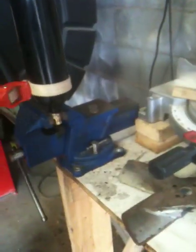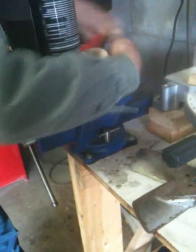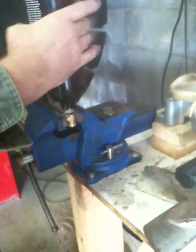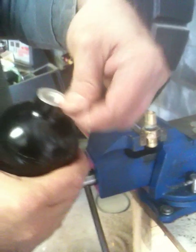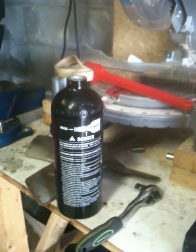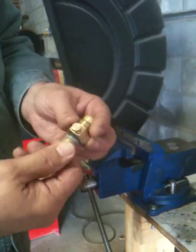The strap wrench turns your tank and unscrews the main valve. The main valve has a rubber or elastomeric seal at the bottom of it, and that seals your valve. Now, it's a good thing that we bled the pressure out of this tank first, because had we not, when we opened that valve we'd have gas come spewing out all over the place. That's the reason why people don't want you to fool around with these things — if you don't know what you're doing, you can get hurt. So once this is out, we're finished with this. This is trash — you can recycle it, do whatever you want with it. About 50 cents worth of brass.